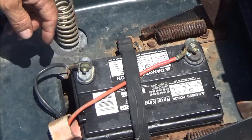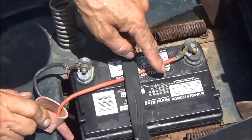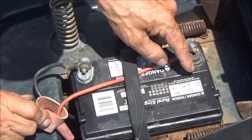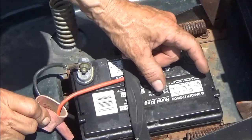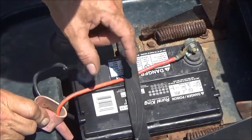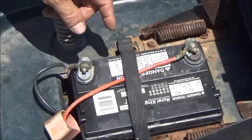There is an overflow vent on both ends of this battery, and many batteries also have fill caps. 12-volt batteries will have one cap that covers three plugs — that's three cells at two volts per cell — and another cap on the other side, so you'll have two caps, or sometimes individual caps. A six-volt battery is going to have three of them.